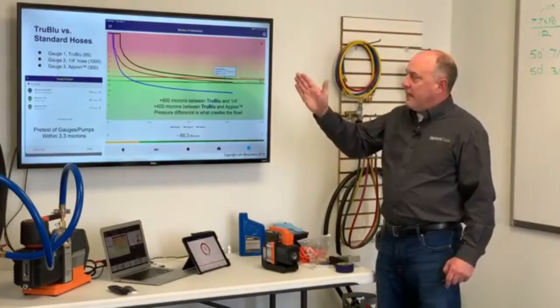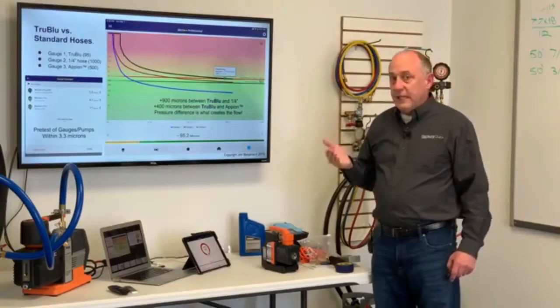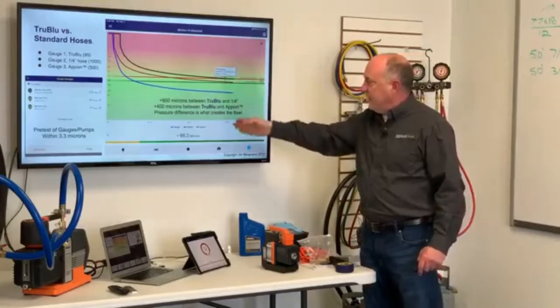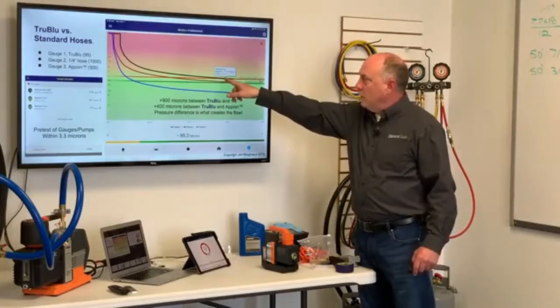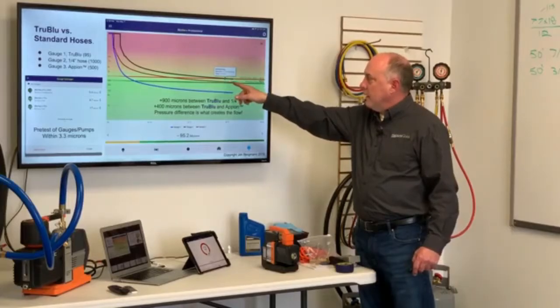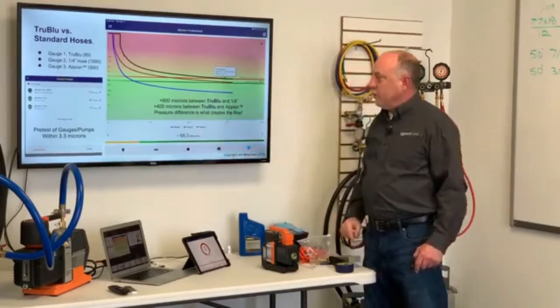And all I did was connect a True Blue hose, an Appion hose, and a 1/4-inch hose to the end of the vacuum gauges and started pulling them down here. This is about 15 minutes in just to show you what's going on. At 15 minutes in, the 1/4-inch hose is at 1,000 microns, right? That's 14 minutes and 33 seconds. At 500 microns here is the Appion hose, and then at 95 microns here, we're at the True Blue hose.